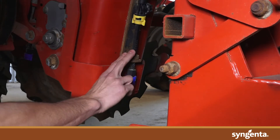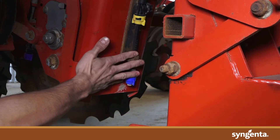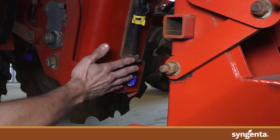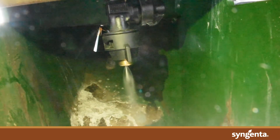In circumstances where the nozzle position in front is not possible because the shoe is going to hit it, you may have to mount this nozzle just behind the tower, just after the potato is dropped.